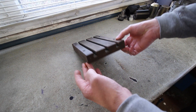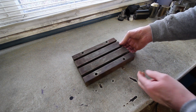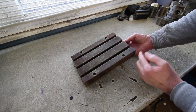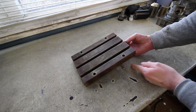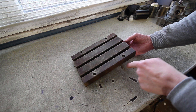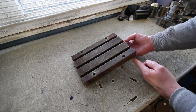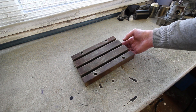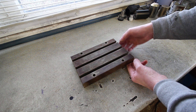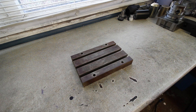That's tricky because I don't have any method of doing that - or do I? I have this very old T-slot table which I think I'm going to turn into a sine table. So what we end up with is: if you elevate one end by a known amount, then the sine of this angle will tell you the tilt very accurately. If you use gauge blocks under this end, you can get really quite accurate results, but you need a round bar at either end with a known distance between the two - that's the hypotenuse.